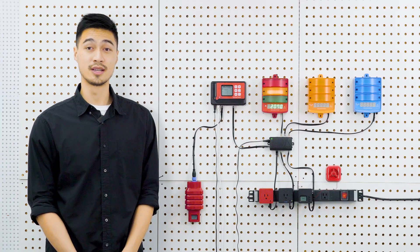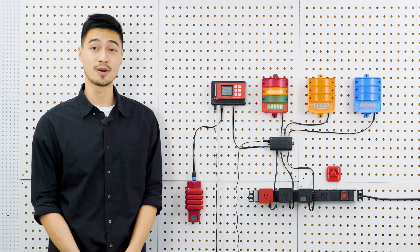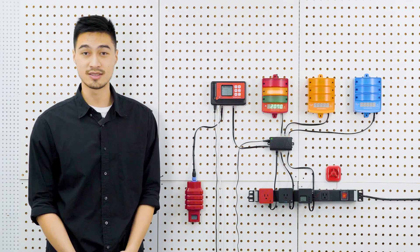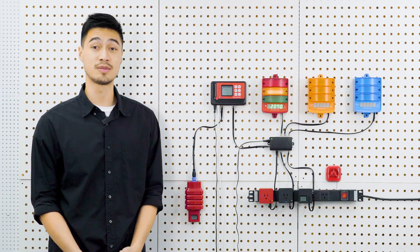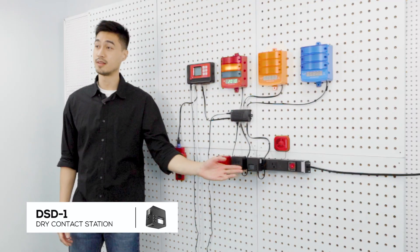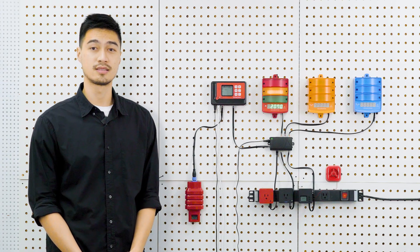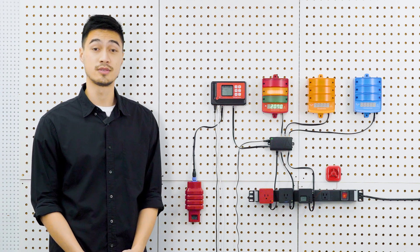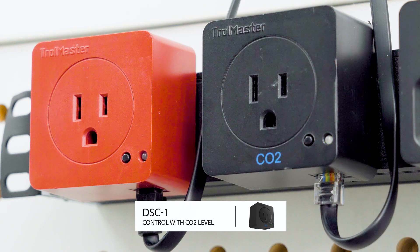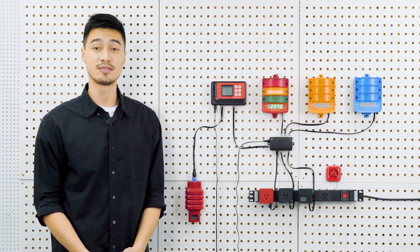The DSE-1 can be used with your CO2 tank or generator and will remain on permanently until an alarm is triggered, after which it will activate an emergency stop and signal power off to anything hooked up with it — including a CO2 outlet, a regulator, a generator, or any third-party CO2 controller. This allows it to automatically cut off the CO2 supply and injection into the room. The DSE-1 is a dry contact output module that provides both normally open and normally closed connections. When connected to the normally closed contacts, it shuts off a CO2 device wired in series; when connected to the normally open connections, it can activate a device such as an exhaust fan or connect to the building's fire alarm panel. The DSE-1 is a 120-volt controlled outlet — typically connected to ventilation fans, which it will automatically turn on when triggered by a CO2 alarm.